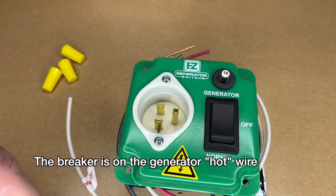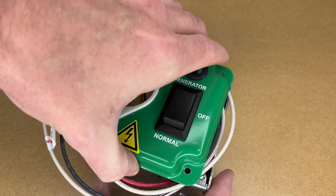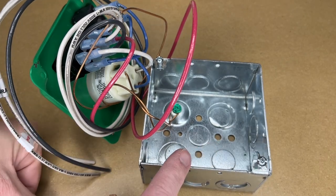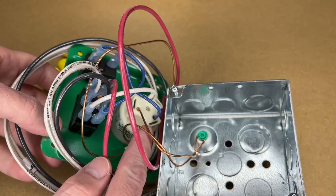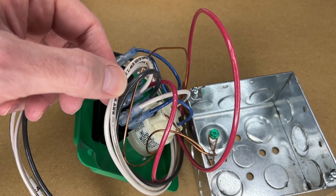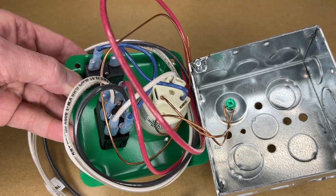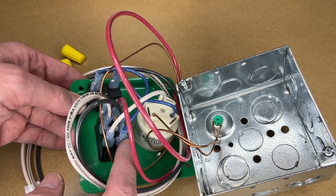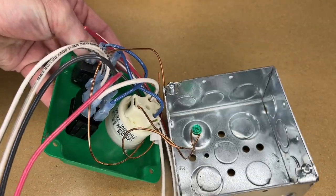This does have a 15 amp breaker on it. This is metal and this part looks like plastic. There are lots of wires in here. This comes with a four-by-four-by-two box and it's a pretty simple device — we have a switch, we have the outlet or reverse outlet, and we have a circuit breaker. This does switch the neutrals. We have the hot coming in from the plug, goes to the circuit breaker, goes to the hot of the switch, and that would go out to this hot.